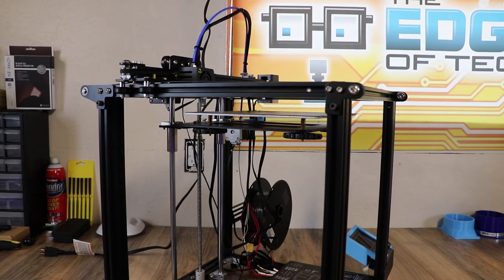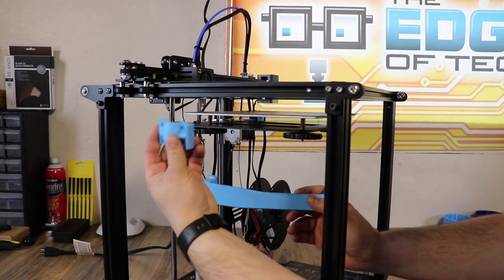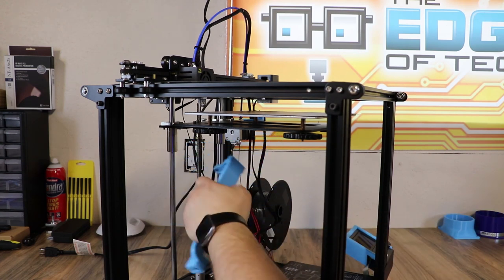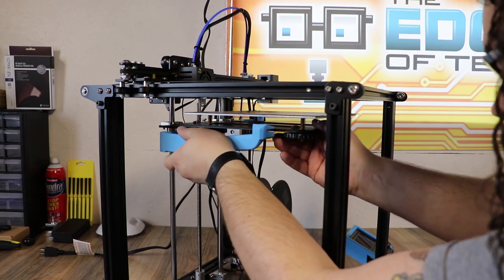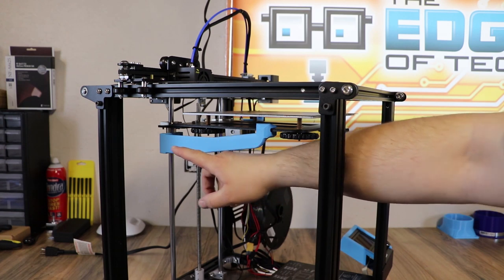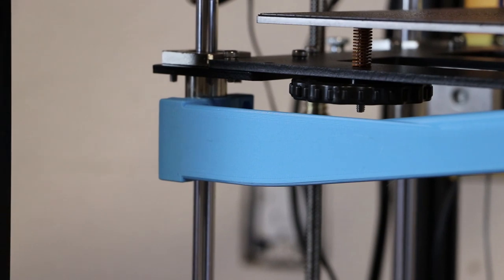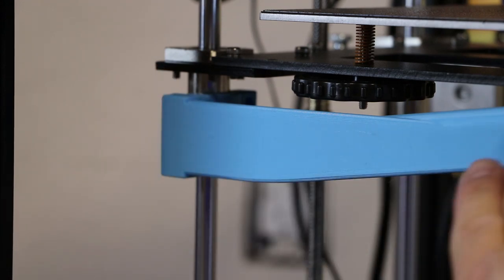The last of the three upgrades are these braces — they come in two pieces. They'll print with each arm piece and a back plate that goes together to hold it there. This piece goes against the bed frame like this and you just push it on and it holds itself there. It does have right-hand and left-hand versions when you print them, so make sure the piece is pushed all the way in and sitting flush against that bar. You'll do that on both sides.